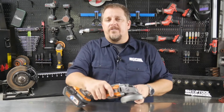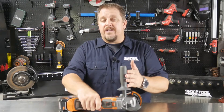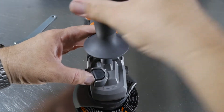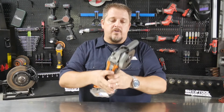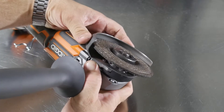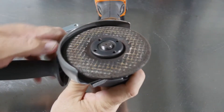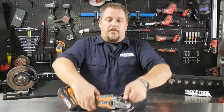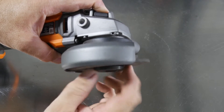Some typical features: as you're used to with 4½ inch grinders, you get an auxiliary handle that is ambidextrous — you can go left or right. RIDGID also adds a top mount, so if you want to put the handle on top for more top-down cutting, you can do that. There's also a tool-free guard — just push the detent and turn the guard to wherever you need it. And there's a spindle lock on top: push it down to lock the spindle so you can change your wheels.